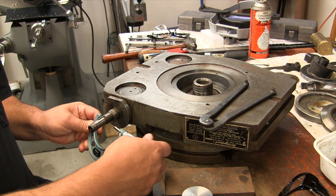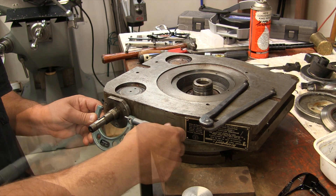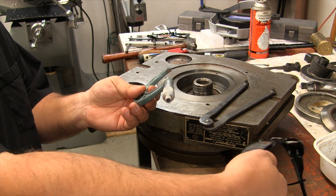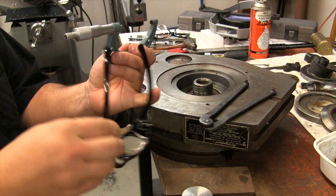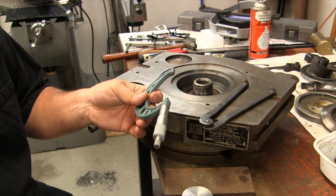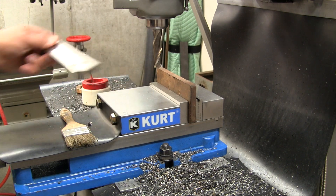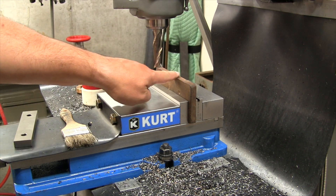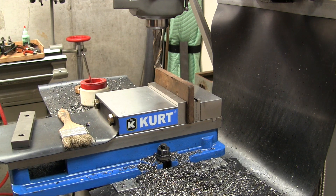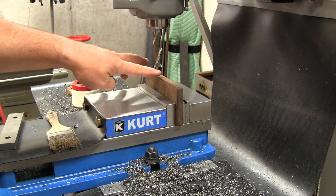What I need to do is take a nice accurate measurement because I don't want the tool to slip. What do my bad eyes tell me? Let's get our cheaters on. Alright, so 736 — we'll make it 737. The hole. First things first, we are going to clean up this side right here with a 3/4-inch end mill so we have a nice true reference surface.